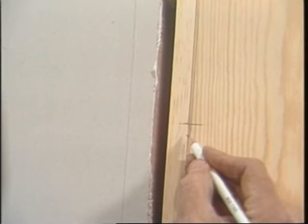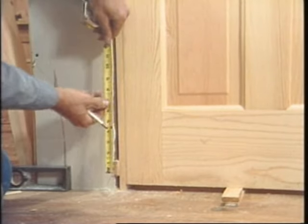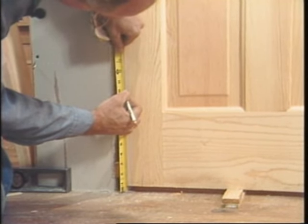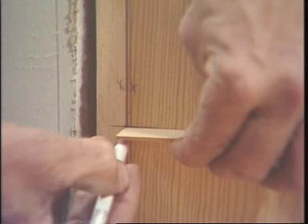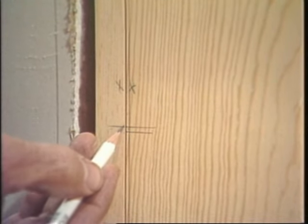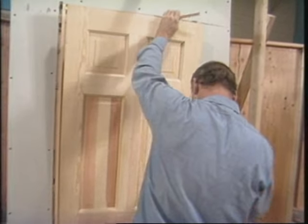Use any kind of a straight edge. It's a good idea to mark the hinge location because a lot of them have been put on the wrong side of the line. Down here on the bottom, I'll use 10 inches. I'm going to make a second mark on here because this is going to be the space left on the top of the door. When I put the hinges on and put this back in place, you'll see these two lines registered — and the same thing on the top hinge.